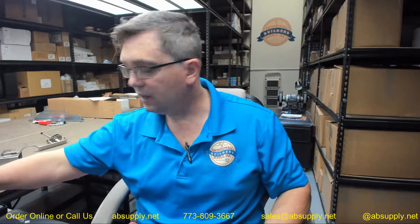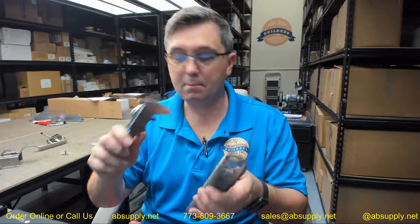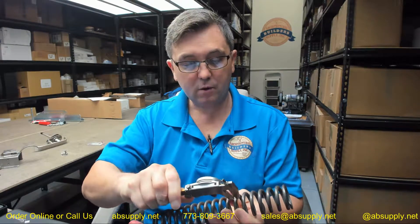which is going to refer to the weight rating that it is intended for, and its dimensional properties. So they have it at .225 wire diameter, and my caliper says that that is pretty spot on at .2245, so .224 wire diameter.